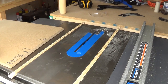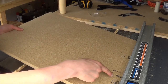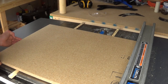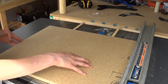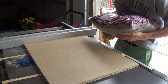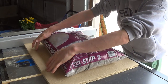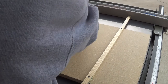You can glue and add some small screws to the bottom, then place your piece right on top. I butt it up against the fence, center it, and slowly bring it on down. You can add a bit of weight to help support it — I'm going to add a bag of sand, and that should do a nice job holding it down. Once the runners were tacky, I took off the board and put a few screws in them.